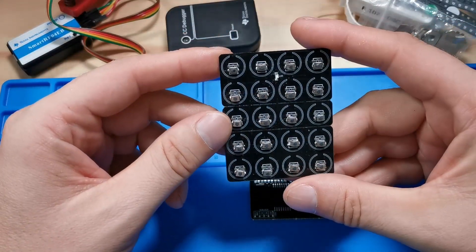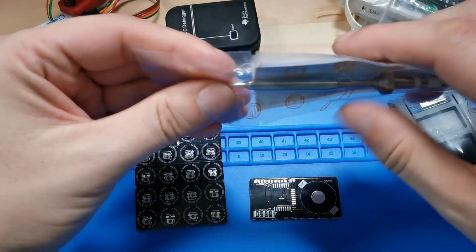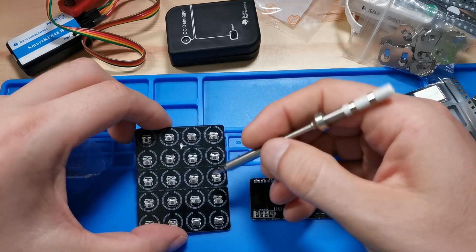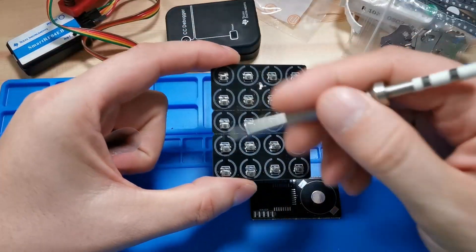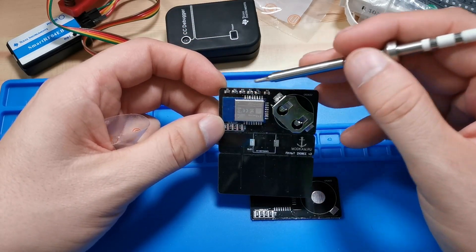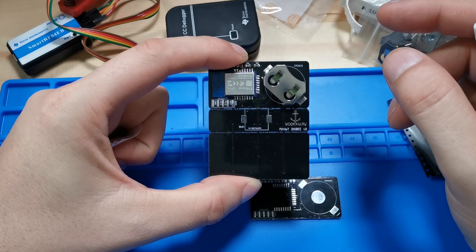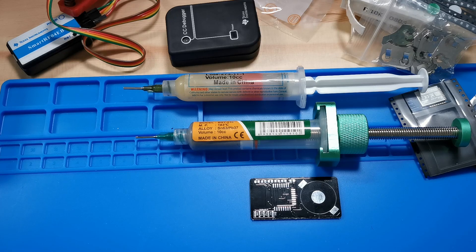When preparing for this video I soldered one board by hand with a soldering iron. Unfortunately I was using a very pointy tip, which was the problem. So I ordered a new tip with a chisel cut, which makes soldering SMD components much easier — the needle type doesn't work for SMD that well. The 20 buttons, LED, battery holder, Zigbee module, and all resistors were hand-soldered with a TS-100 soldering iron. For this video I will be using hot air, which requires flux and solder paste. Now enjoy a quick time-lapse of me trying to solder all the components.